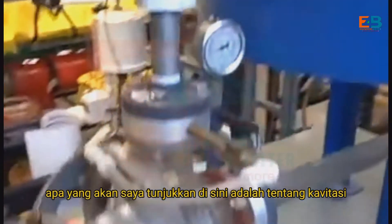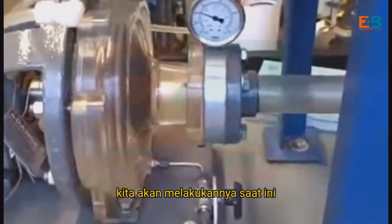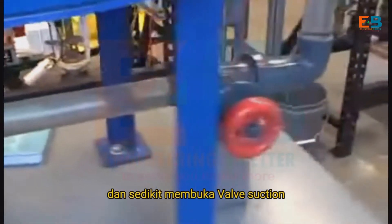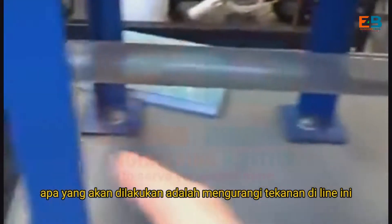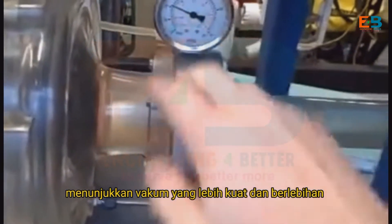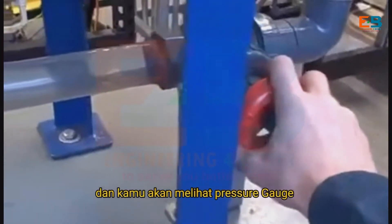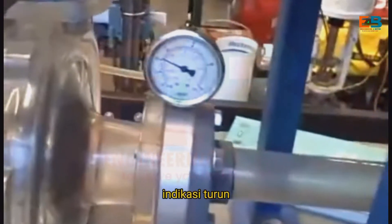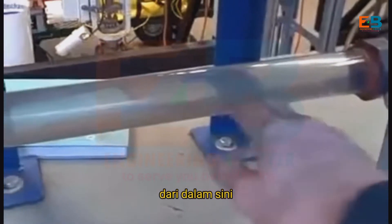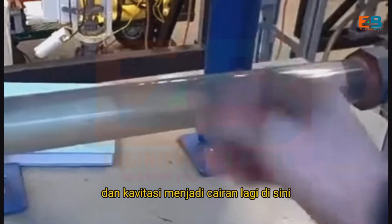What I'm going to demonstrate here is cavitation. We're going to purposely cause cavitation to occur in the system. We're going to do so by keeping the discharge valve wide open like it is and pinching off the suction valve. What that will do is reduce the pressure of this line, and you'll see this compound gauge show a stronger and stronger vacuum as we begin to pinch off this valve. You'll also begin to hear cavitation take effect, and we'll be able to see the bubbles form inside as it cavitates — flashing into vapor and cavitating back into liquid again.